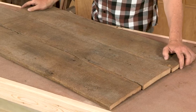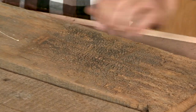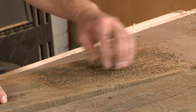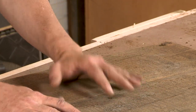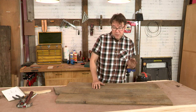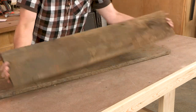Now, with reclaimed wood you need to look for some problems. It's beautiful — rich with patina and age. But sometimes a surface like this might not be a good choice for a tabletop, even a coffee table that doesn't see a lot of use. This is called mud crack — a drying of the wood — and it flakes off and is very soft, so that would not work for the top. On the other hand, a more stable surface after very light sanding that would not take away the color could be a nice gray top. When we sliced this board, I smelled it and it smelled like oak — probably white oak, which was a nice discovery. We'll be able to verify that once we join the underside of the board.